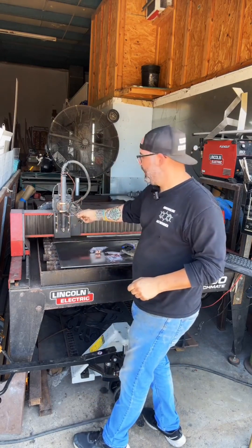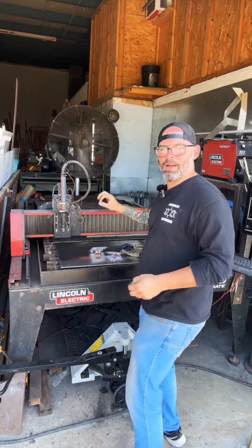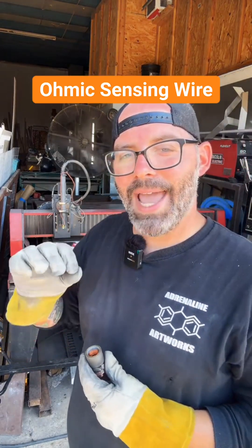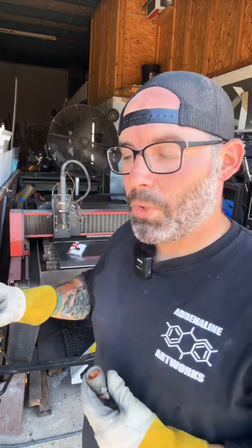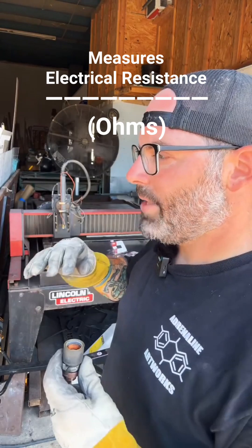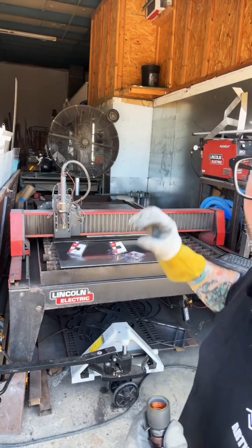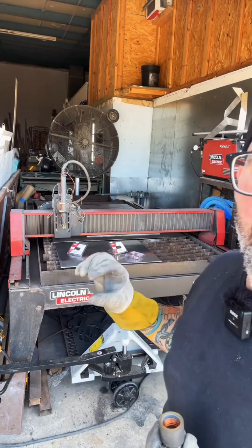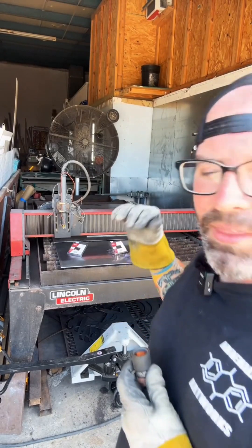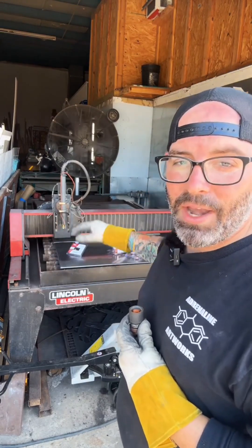This little orange wire right here is a sensor wire — an ohmic sensing wire. It detects resistance between the electricity in this cap and the material, measured in ohms. That wire is the sensor, which tells the computer how high off of the material the nozzle is.